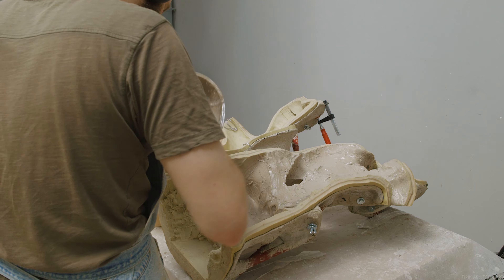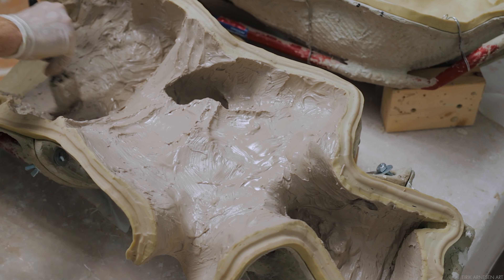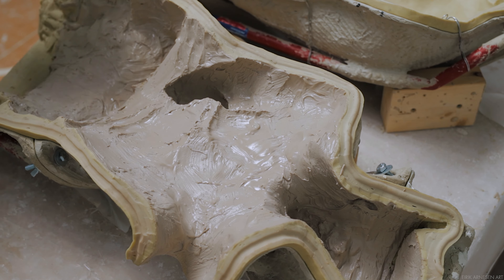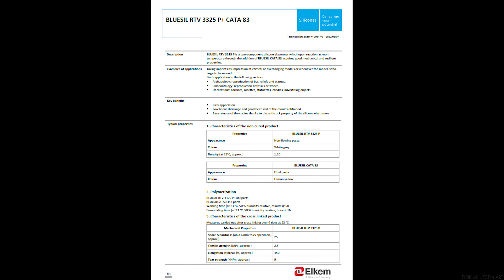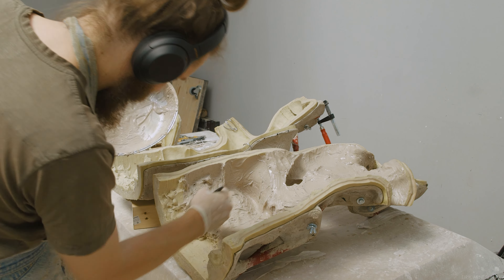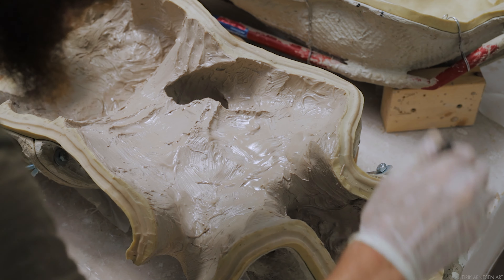The only thing I think you should consider wearing a mask for is when you are mixing the material, as one component is a powder. Any sort of dust or powder — even plaster powder — is not going to be good for you to breathe in. I'll leave this decision up to your discretion. I suggest that before working with any material you get hold of a technical data sheet for that material. Whoever you purchase the material from, if it's a reputable source, will have the technical data sheet on hand and should be able to provide it for you. Always read through these before beginning to work with any new material. Remember, you are responsible for your own safety, so take that safety seriously.